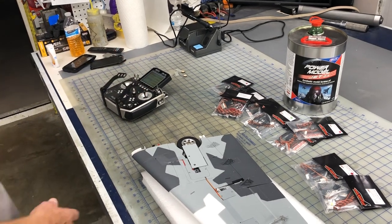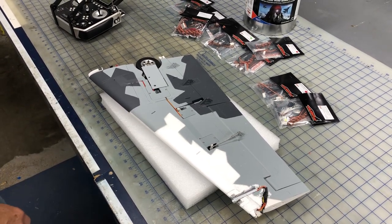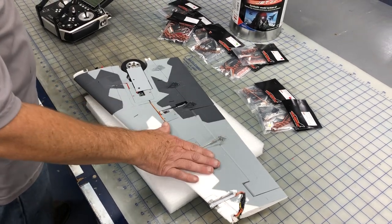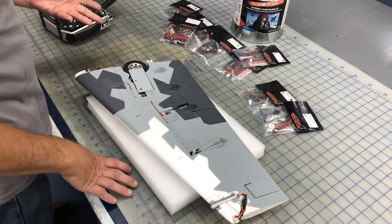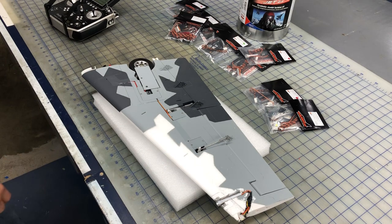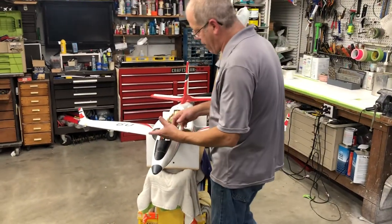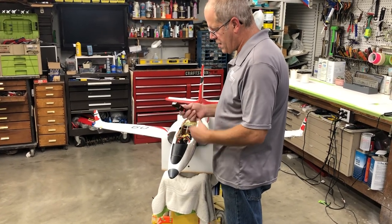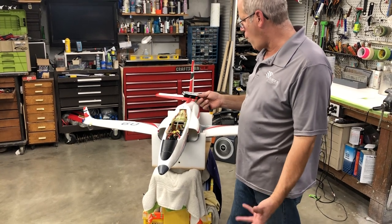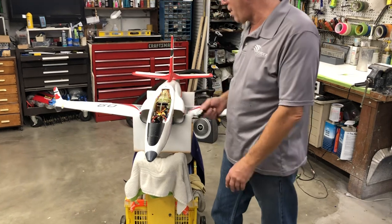We'll start tearing into one of these in the next videos. There'll probably be a series of at least four, maybe five videos on the complete Unilight setup, and it'll apply to the ViperJet the same as a T-33 or any other model — every model I fly has Unilights on it. The model does require an extra battery for the Unilights; I'm running an extra 2S 2000mAh LiPo. The Unilights use quite a bit of power — you'll pull maybe 400 milliamps per flight just for the lights, while the turbine and the model electronics only use about 150 milliamps.